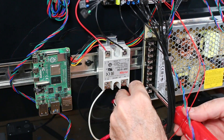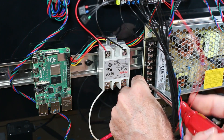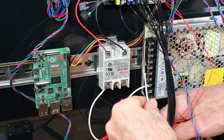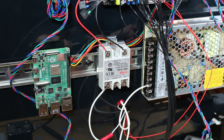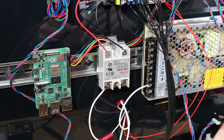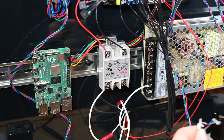I'm connecting the other wire coming out of the plate to the power. I'll connect one end of 110V directly to the SSR relay, which finishes the circuit. One of the wires going into the plate is connected to the relay through the thermal fuse, and the other side is connected directly to the 110V line.